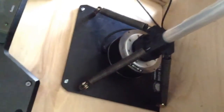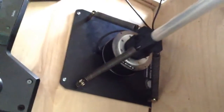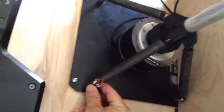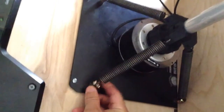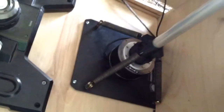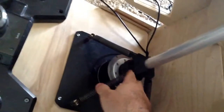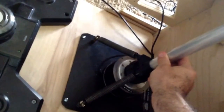And once you're all finished, these will still be loose, kind of bending over. What you want to do is turn the stick over, then tighten each clevis with your screwdriver. All you need to do is take some pliers to hold this straight, because it'll want to twist when you're trying to tighten the clevis down. Then basically after that, it's all done. The last part is the cable.